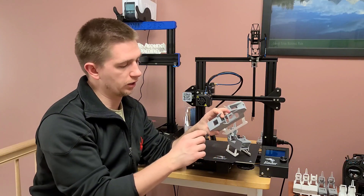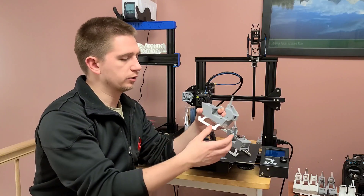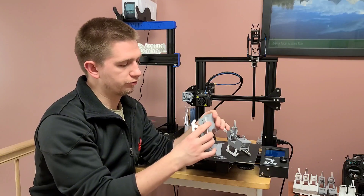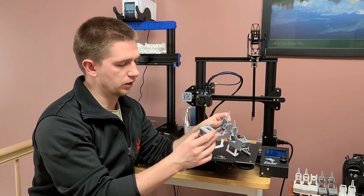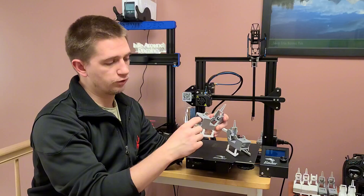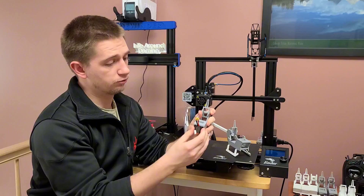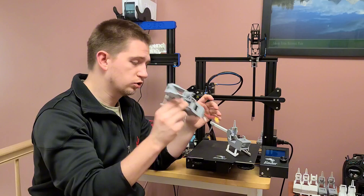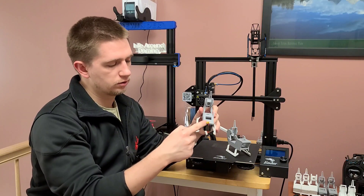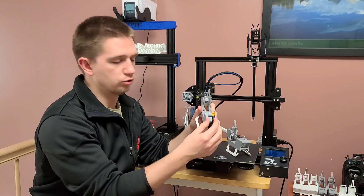There are certain features I kept forgetting. For example, I forgot to put a hole here because there is a heat sink on the bottom of the flight controller, as well as a hole on the battery so that there would be airflow when you're flying to cool down the battery. This time I ended up with a simple design for fitting the battery into the airframe — it's a very tight fit, it will not ruin your battery, but it's so tight that you do not need the front airframe protector to fit your cables in. Once you plug it in, you should be absolutely fine.